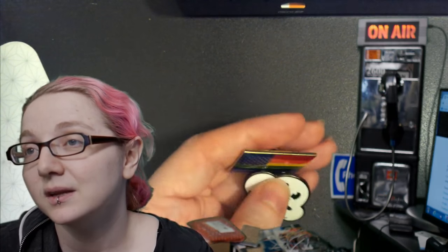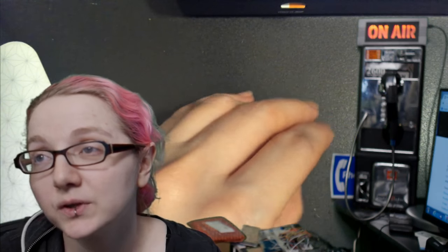Next up. Why would we use MQTT instead of COAP, C-O-A-P? We decided to go with MQTT because COAP, I think, is a little more stateless, and we wanted to have some idea of connection. MQTT also seemed to be what people were using the most, so we wanted to go with the standard that was very popular. A lot of people were using Mosquitto, and a lot of other services were using MQTT to do this kind of data transfer. You know, I'm not against COAP. We might add COAP support to Adafruit.io, but right now we only support REST and MQTT. Okay.